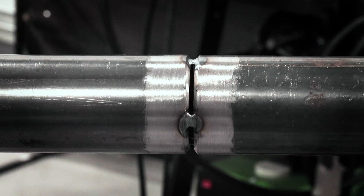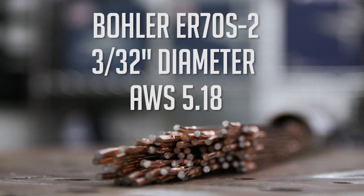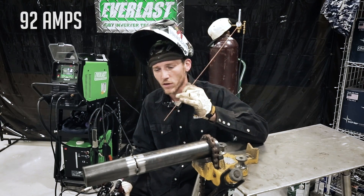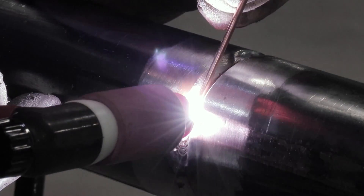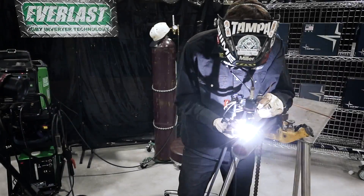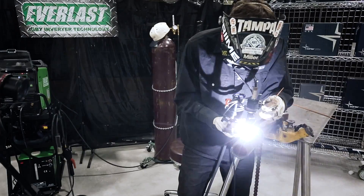We got the second piece we're going to be welding on — it's a piece of two-inch carbon pipe, open butt. I'm going to use the Bohler ER 70S-2, the AWS spec A5.18, with the machine set at 92 amps. I'm going to start this one with the dab technique.